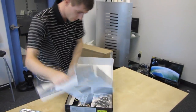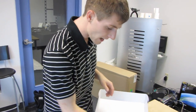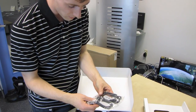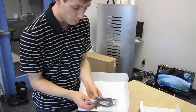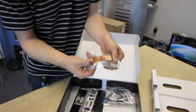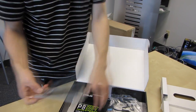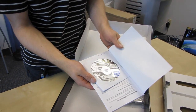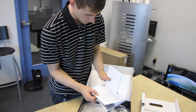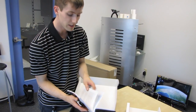Now let's look at the accessories. We've got a USB header to dual-port PCIe bracket for the back, so if you don't have front USB 3 you can add a couple more ports. There are two SATA 6 Gb/s cables and two SATA 3 Gb/s cables — they're identical other than the white color on the 6 Gb/s ones — and they're all right-angle. We have an SLI bridge, Q connectors for easy front panel header installation, an IO shield, a user guide, a Drivers and Utilities DVD — though I'd recommend downloading the latest from the ASUS website — and a SATA mode notice explaining how to enable AHCI mode, which is better than IDE mode for performance.